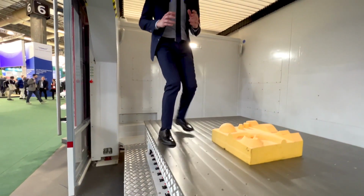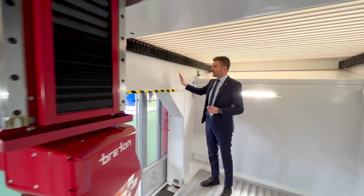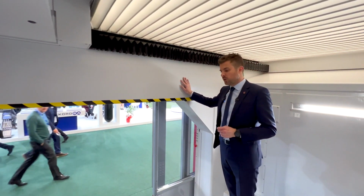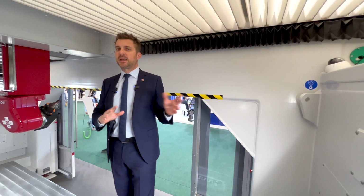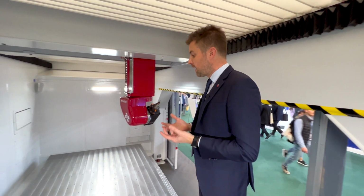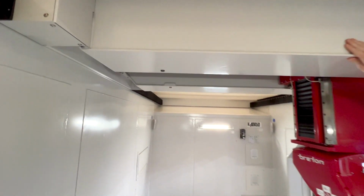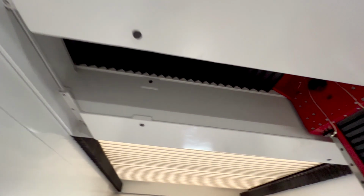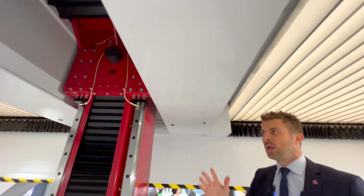Hawx is made solid from the bottom up. We're using a monolithic structure, which is made of one-piece welded construction to improve the stability and the rigidity of the wall of the machining center. And on top of the structure, we're locating this box design bridge, much stiffer than what you can see around in the other machines of the category.